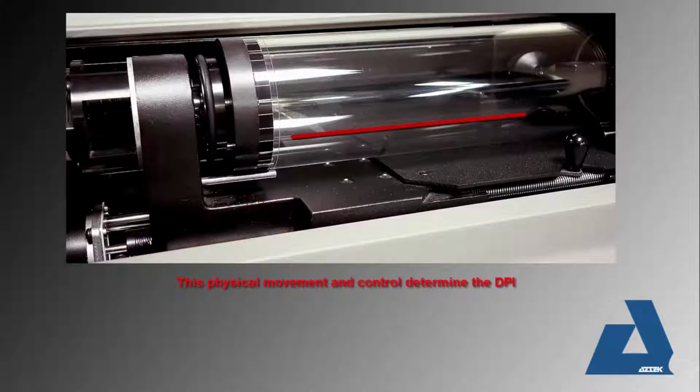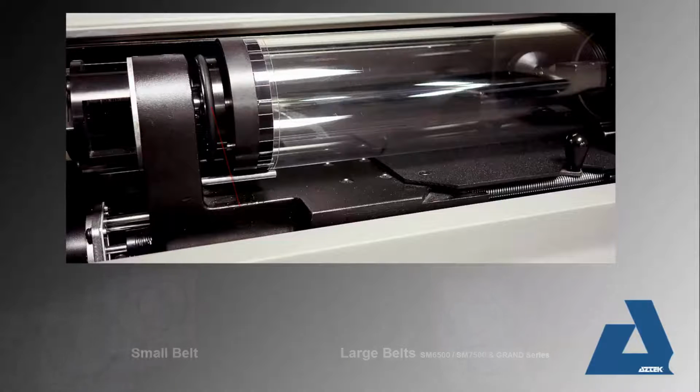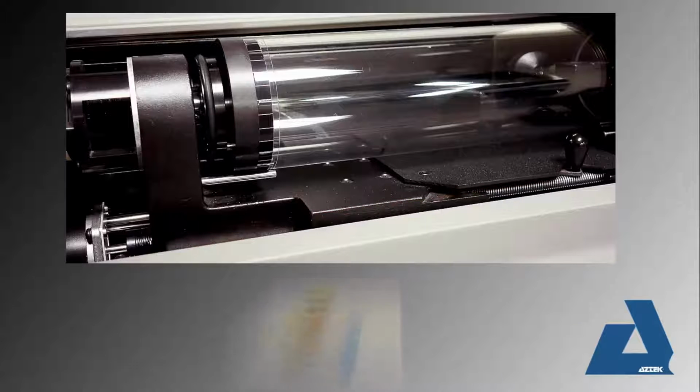Between the really expensive encoder and motor is a sacrificial belt, and this belt should be replaced when it's stretched or cracked, and it's usually every year to 2 years. The next maintenance item is the lubrication of the lead screw, and there's a particular synthetic grease with a detergent that should be used, that you can buy from us.